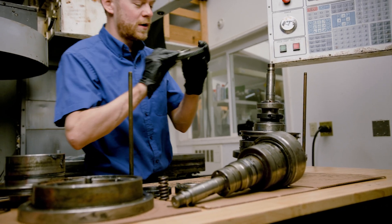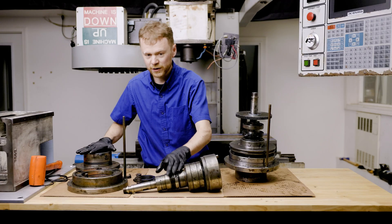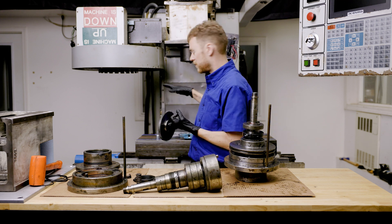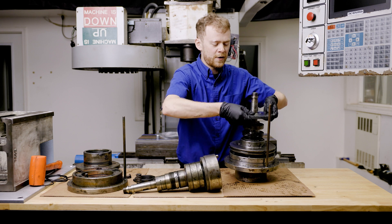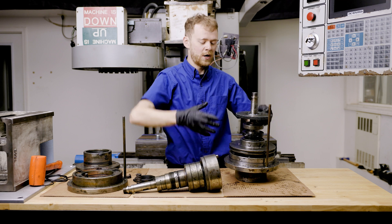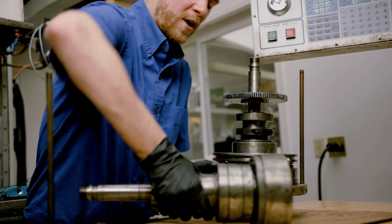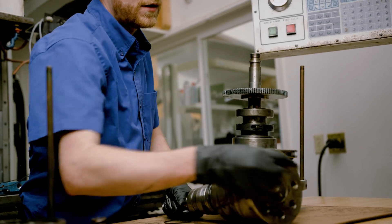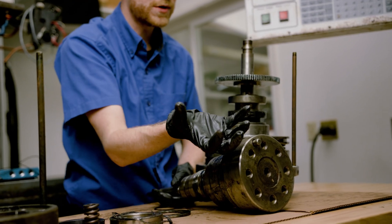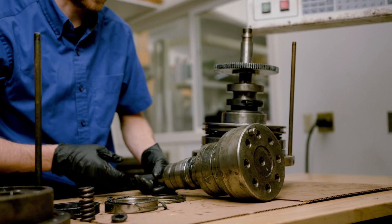So how does it work? This gear sits on the back of here. This is an early turret design revision; this is the later revision design, so the gear doesn't perfectly match, but the piston rebuild kit is the same. There's another gear in the back of the turret box, another gear, and the servo motor for the A-axis. Air pressure comes in here, it separates and unclamps the turret. These big bolts bolt through your turret, the motor runs and indexes to either a half position or a full position, then air pressure clamps the whole thing back onto the Curvic coupling behind it.